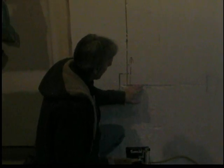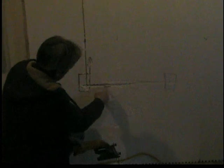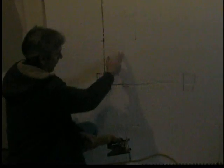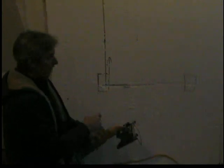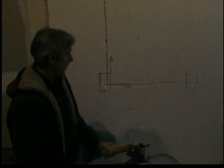The only time you really have to worry about the wire is when you're crossing the furring strip. In this situation, you've got guys screwing drywall through here, and there's a potential if you don't get it back far enough — where these furring strips are lined up — that they can hit it. So you've got to make sure you get it very good in there.